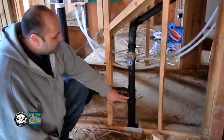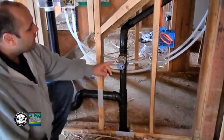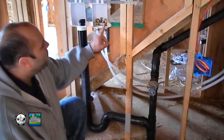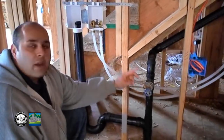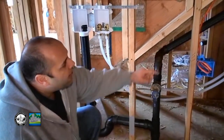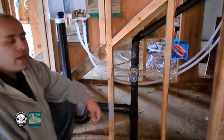We're going to go into our santee. We notice we've got a 2 inch drain and an inch and a half vent again. If you notice this little device here, this is set up so the plumber can fill the water system without going onto the roof. He's going to hook a hose to here and a hose to here, then turn this system on, and when water comes out the vent on the roof, he goes in and turns it off and he's ready for his inspection. The vent comes up through the back of the stairs and we've got our nail plates again, secured for maintenance and repair.